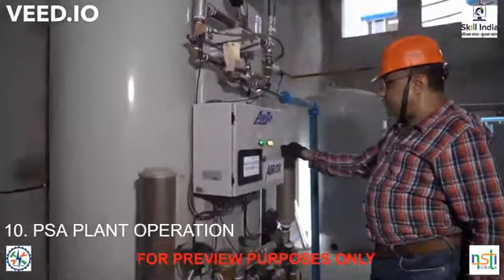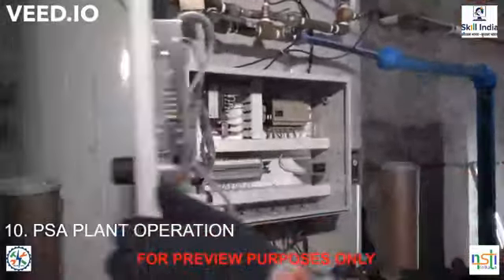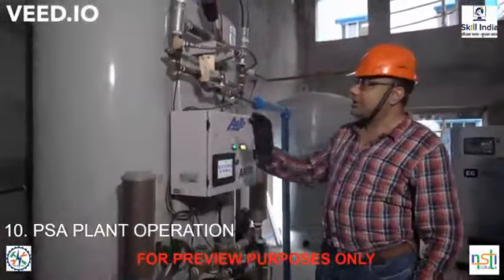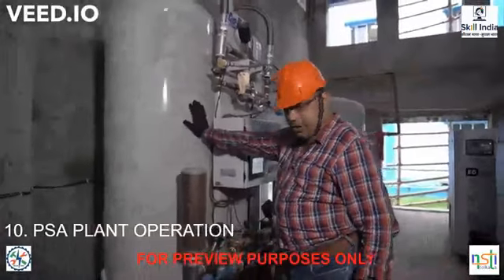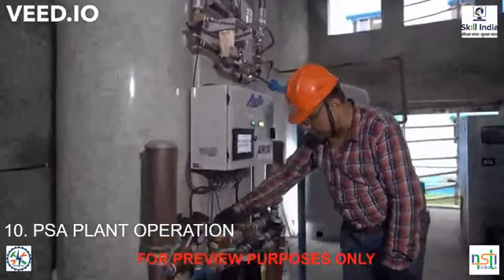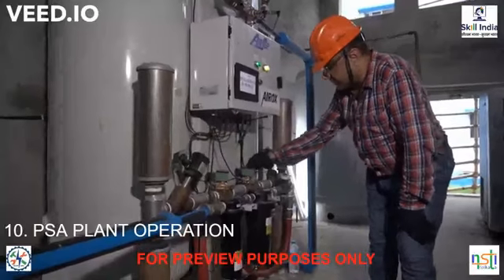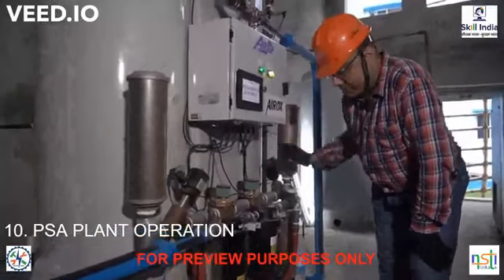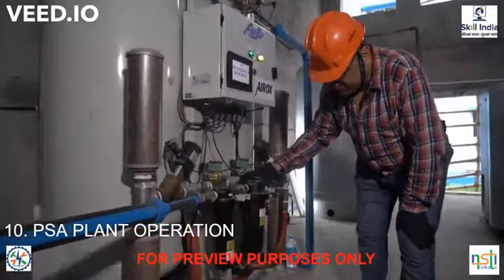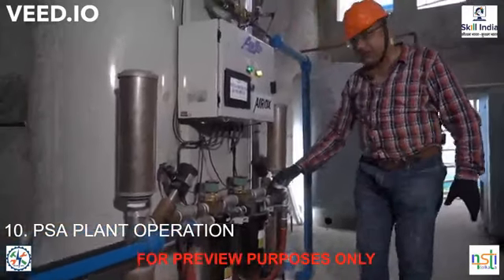In the second part I will go to the control panel — that is the PLC — and then the HMI. We need to fill this chamber: this is Tank A and this is Tank B. Valve 2 is the inlet to Tank A, and Valve 4 is the inlet to Tank B. This is the header from which dry and compressed air is coming. There are two filters: one is a pre-filter and the other is an oil coalescing filter. This is the air regulator.